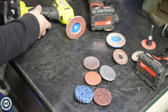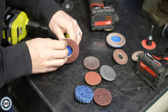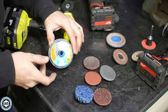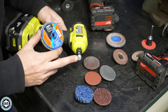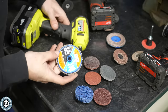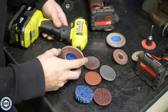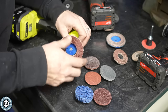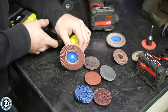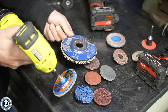Something a lot of people are not familiar with is the larger version — essentially a three inch combi-click. This one works in the opposite way in terms of engagement: you've got a male thread on the end of the die grinder with the same quarter inch shaft, and a poly fan disc with a female thread that just threads on. This thing does a little more work because it's got a larger surface area, and you can still get into tighter places and be more nimble than a four and a half inch flap disc.